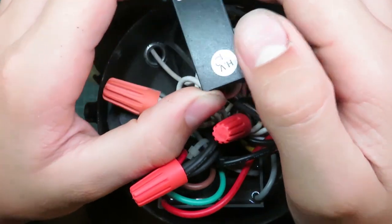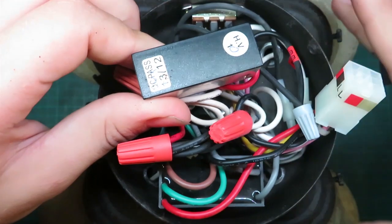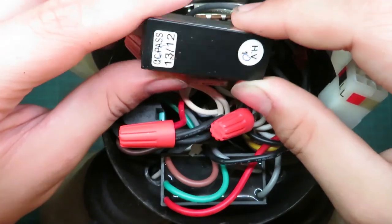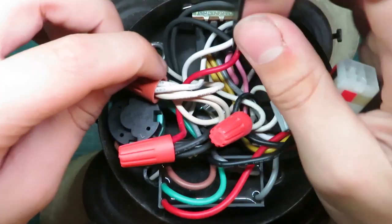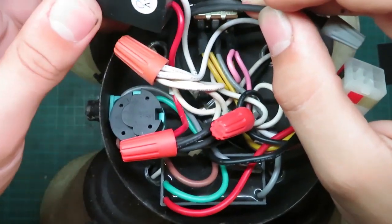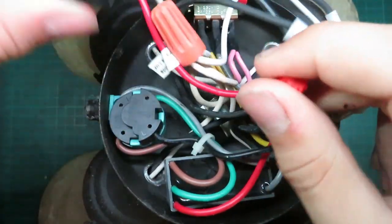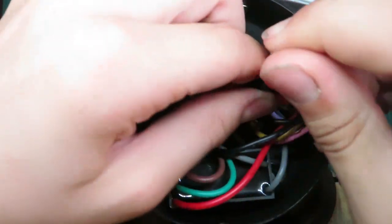We have it on the bench now and we can start diagnosing. This right here is a wattage limiter. Basically, if you have a lot of high-wattage bulbs hooked on to this, it will stop the circuit from turning on — because over-wattaging can lead to over-current, which can burn your wires and potentially start a fire. So that's there for safety and protection.